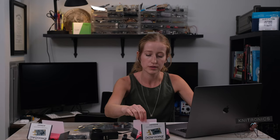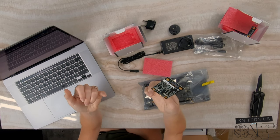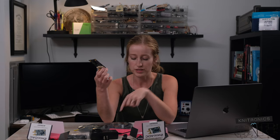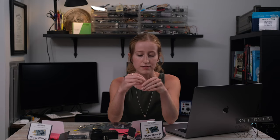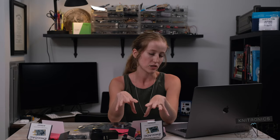So I think what I'm most interested in is how to interface initially with these Zmods. Typically all like an ADC or a DAC is always going to have some sort of serial interface to communicate from whatever your MCU host is — such as an FPGA or a microcontroller — to pass data back and forth. And it's always, even though it says it's SPI or I2C or whatever, it's always a slightly unique take on it. There's always some little gotcha that I feel like I spend a stupid amount of time getting SPI interfaces to work with ADCs and DACs. So the first thing I'm really going to look for is there has to be a library already for interfacing from the Eclipse to these Zmods specifically.